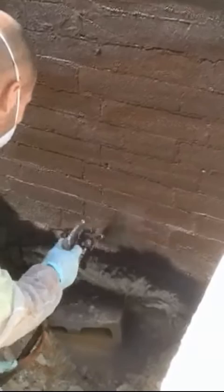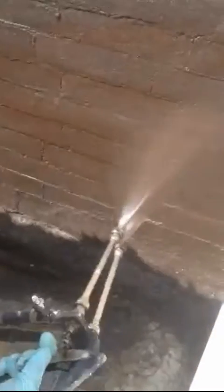You'll see in a minute he'll work his way down. Liquid rubber, being an environmentally friendly product, we can use it in these close confines. It doesn't really cause any issues. You can see he's working it way into all the little divots and holes and the courses of the brickwork. Slightly rough this wall, so he's having to work at it a little bit harder than normal. It's coming up a treat and this is only a small portion of a fairly large job.